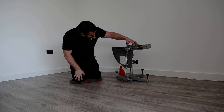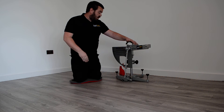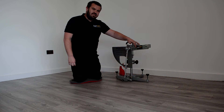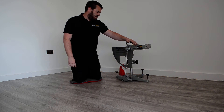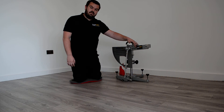When we come down to 24 PTV, that's the bottom end — anything less than that is deemed as a high risk of slip. At 24, it's about one in 20 people may find that the floor feels slippery underfoot. And that gap in between 24 to 36 is our moderate risk of slip.